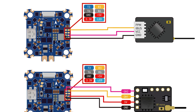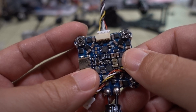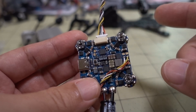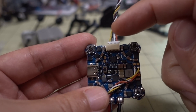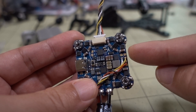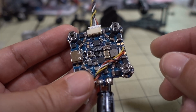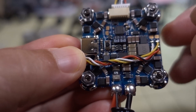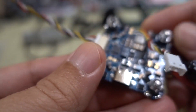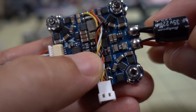I'll put up wiring diagrams for this board, and the product page also links to the manual. There are five total UARTs on the board even though it's an F4 — it's actually an F405 chip. One UART is for ESC telemetry, UARTs 1 and 2 come out of the main plug, and UARTs 4 and 6 are on the side pads. You also have buzzer pads, a bootloader button, and a USB Type-C connector, which is nice.